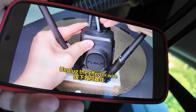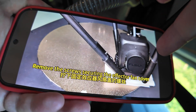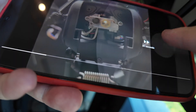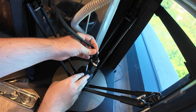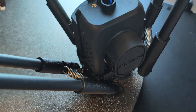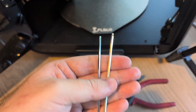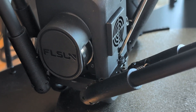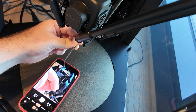I couldn't get it to feed forward or unload the filament, so it was time for some disassembly to manually dislodge it. Luckily a video guide is available, but unluckily this is the worst designed extruder assembly I've ever come across. The first step was to remove the cable, the air duct, and then two screws — one on each side. The first screw is easy to get to, but the second one is impossible to remove with the included hex key. The trick is to use one with an angled tip. After that there were 6 more screws on the underside, and I had to use my phone camera so I could actually see what I was doing.